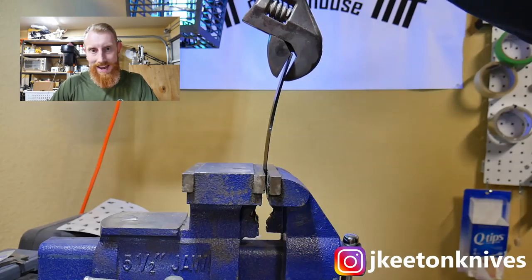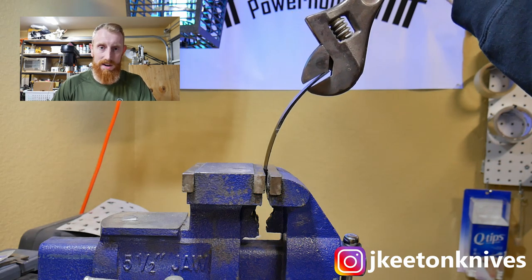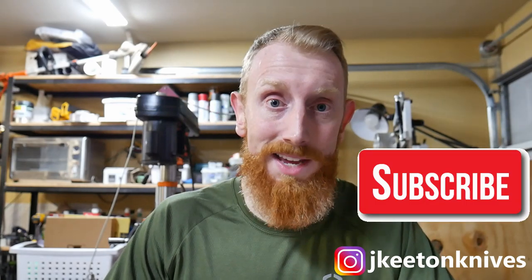You now have a tempered, usable, flexible, durable blade made out of 1080. It's by far the most forgiving steel for a new knife maker because you don't have to soak it and you can heat treat it in your home forge. If you want to use more exotic steels like stainless or D2/A2, no problem — but make sure you send them off to a professional for heat treating so you don't end up with a bad product. I hope you enjoyed this video. If you liked it, hit the like button, subscribe for more knife making content, and leave a comment below.